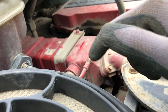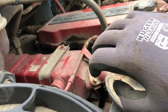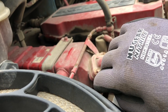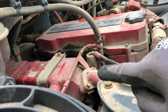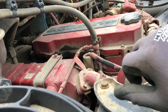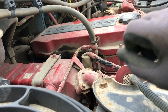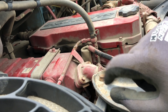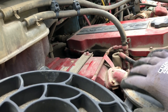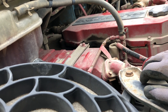What can go wrong with the EGR cooler is the coolant will start leaking back into the intake, and that's going to be manifested by white smoke and smell from the exhaust. If you really ignore it, it will eventually leak too much coolant back into the intake and hydro-lock the motor. The motor will have a hard time starting in the morning and will run rough for about a minute before clearing. You'll also notice you're losing a quart or two of coolant a day, depending on distance and hours run.